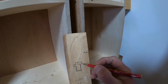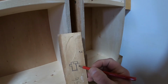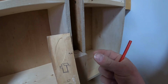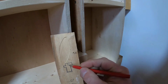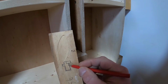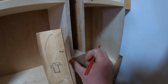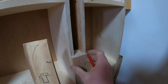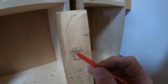And that's what this edge was for, to hold onto this edge. But if I have 24mm, two pieces of 12mm stuck together, I can actually put them offset like that, so that the front piece will actually overhang this, and if I attach it onto there with glue or whatever, then that will hold this in place and it won't wiggle around. What I'm planning to do for the top and the bottom of this will actually stop it from twisting too, I believe. It's just 12mm blocks on the end like that.